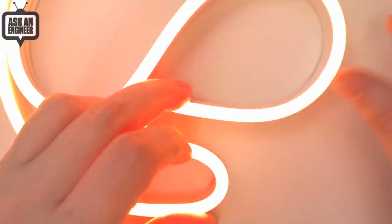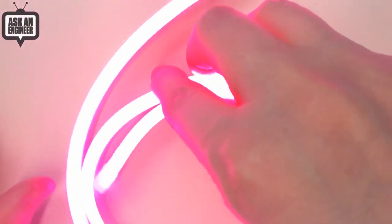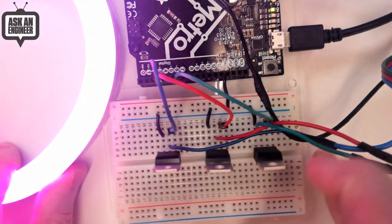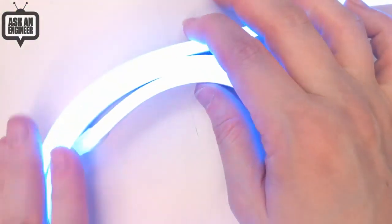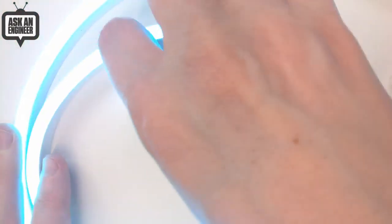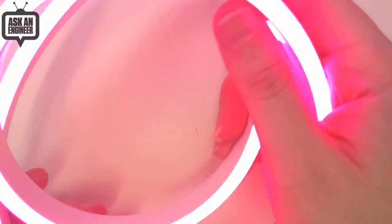It's extremely flexible, so you can make all sorts of cool shapes with it, and it's extremely smooth — there are no hot spots, which is really nice. You get a very consistent color all the way through, and remember the whole strip will be the same color; there are no addressable LEDs. We're working on getting a skinny addressable LED version. This version is 12-volt power and you need three MOSFETs to control it. It's one meter long and totally weatherproof. I wouldn't put it underwater long term, but for outdoor usage — decorating your bicycle, backpack, an event, your float, or your costume — this will do the job very well. You can set the color to be any color you like. So that's flexible LED neon RGB.